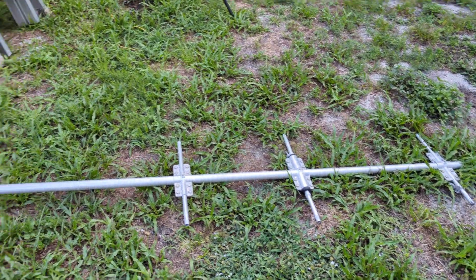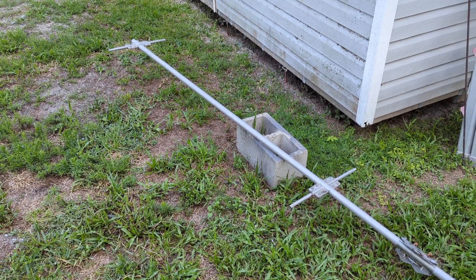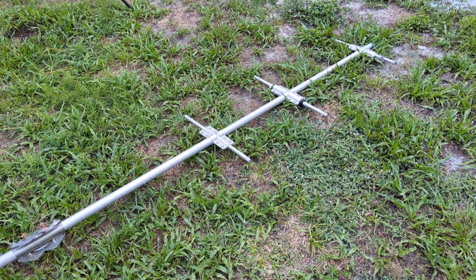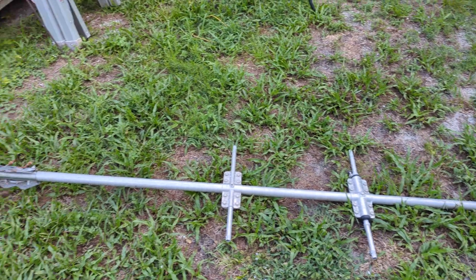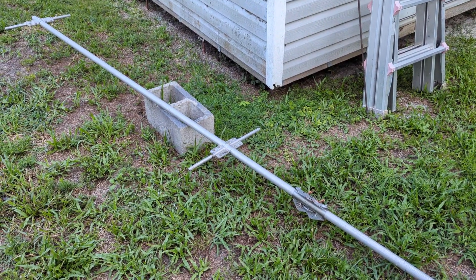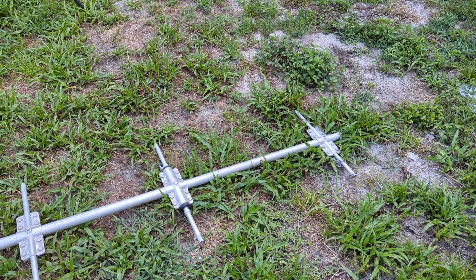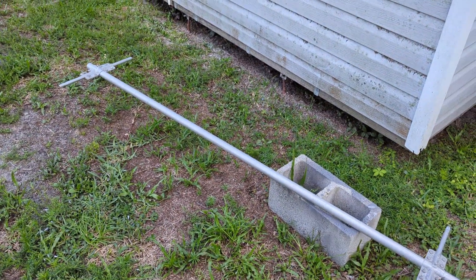You may say this is way stupid and it's never going to work. Well, that's what everybody said about that over there. I have to do this in order to learn things myself. I've learned so much about circular polarized antennas, how they work on moon bounce, and the difference between different types of Yagi. That's what ham radio is — experimentation. I've already proved a lot of people wrong, so I'm going to try to do it again. The only thing I'm worried about is that the 1271 — that old vintage ICOM — I'm going to have to put it on the service monitor and see what it's looking like. Maybe a little off frequency, and it's got to be very precise. It is 10 watts, and some people say you can do EME on a single Yagi at 10 watts. The ICOM 9700 versus the 1271 — well, that 1271 was made in '87, so there is no way to hook up a GPS reference clock like the 9700 has.